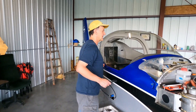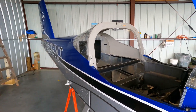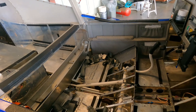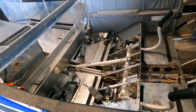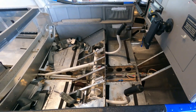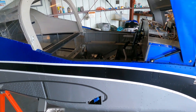On the inside, we actually take out the entire interior. You can see we get down to all the controls — we take off the covers. Controls are very important. Make sure no cotter pin is missing, no cable chafing, and all the pulleys are moving well. After we inspect all the controls, we're going to lubricate them all with LPS lubricant to keep everything moving nice and smooth.